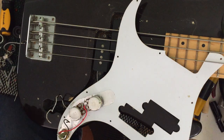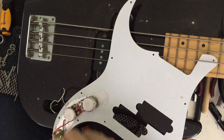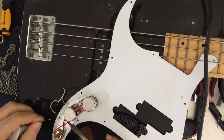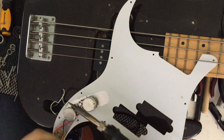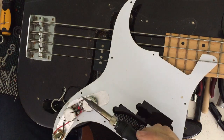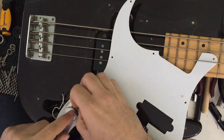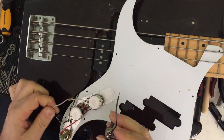That pot can go in the bin. What I'm going to do now is attach this ground wire to the side of this pot right here. The reason I'm doing the side is because that way it's nowhere near the wipers — it's tucked away, out of the way. I'm going to run the ground from this side of the pot right here. I'm going to fill up some more solder in here and run this wire down to the side of the pot.